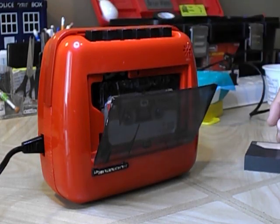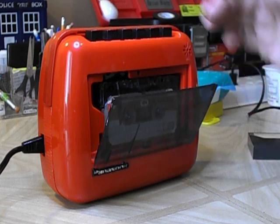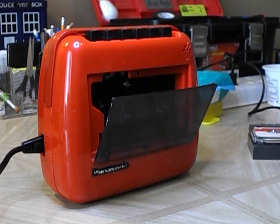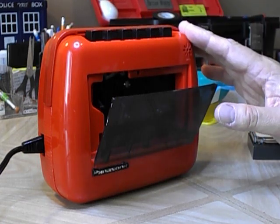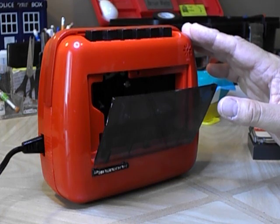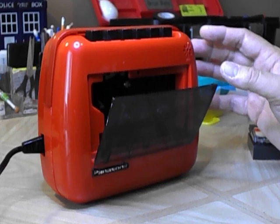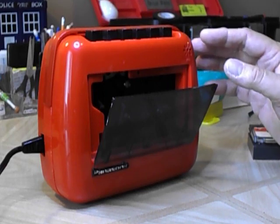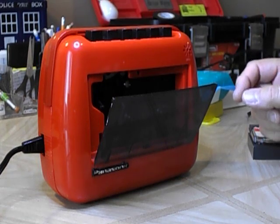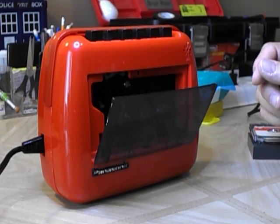I won't go on to protect the innocent, but it amazes me. This tape still plays just fine all the way through, not shedding any oxide. This tape recorder — although the belt was okay on it — there was no audio. It was very garbled, very low. There are only about six or seven electrolytic capacitors inside. Very small board on this side. I just changed all the electrolytics, and it came right back to life.